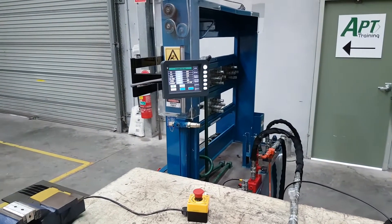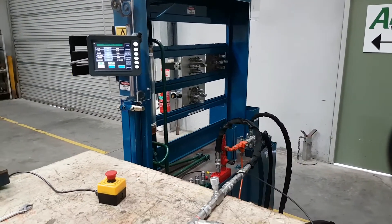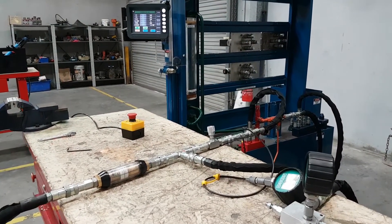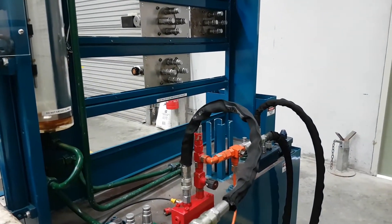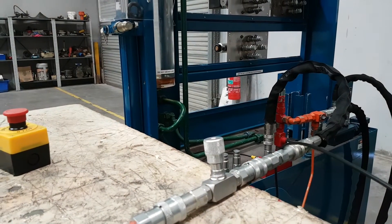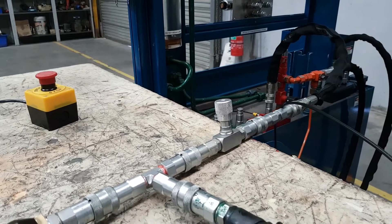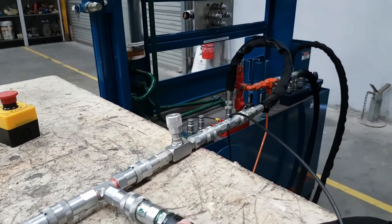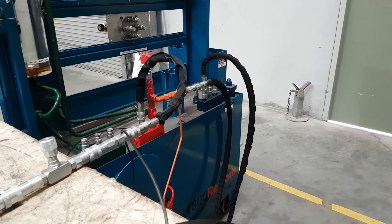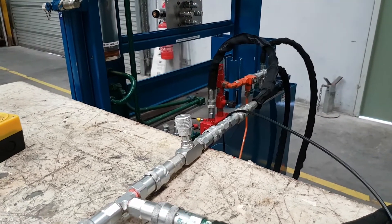We have set up our variable speed rig. This is our PLC and variable speed pump. All we've got set up today is over there — we come out of our pressure line, which is red, along to our flow control. The flow control sets the amount of flow coming through the circuit. From there we have our signal line, which travels all the way back to the pump down that orange line, giving the pump the signal to deliver flow. It's on the downstream side of the flow control.